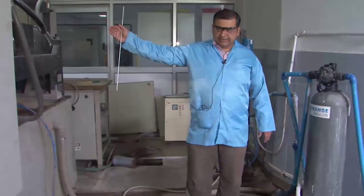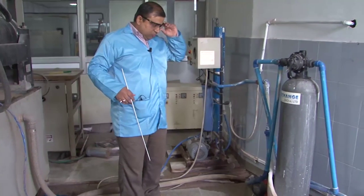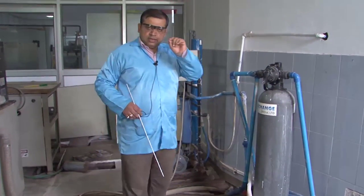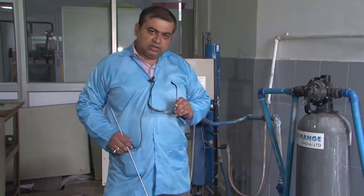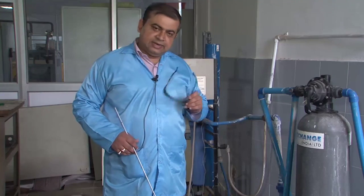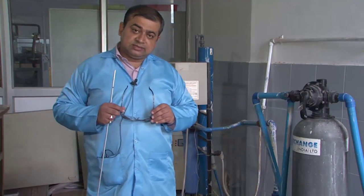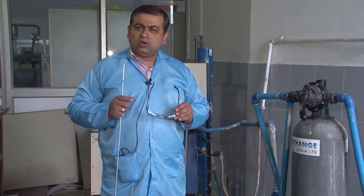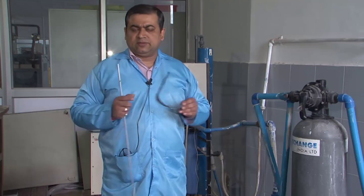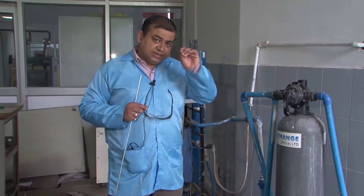At the back of the machine, on the right is the abrasive jet machining unit, and on the left are water lines forming the water handling system. It is critical to use high-quality water with minimal impurities. Reverse osmosis and deionization are performed together for good filtration and reduced ion content. At such high speeds there is substantial temperature increase, and impurities or ions would cause rapid nozzle deterioration and more frequent nozzle replacement — so water filtration is very important.